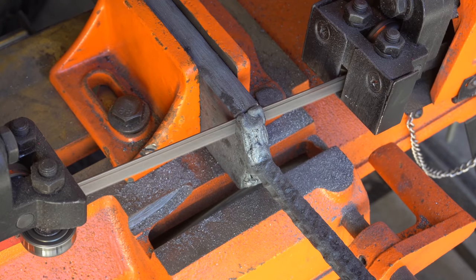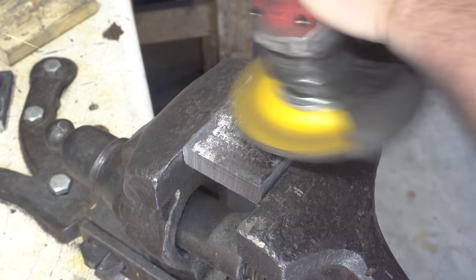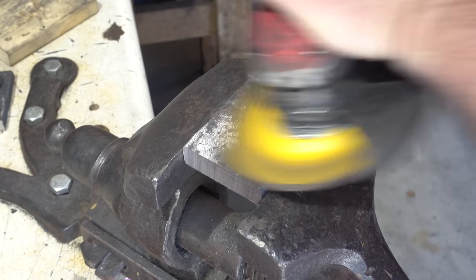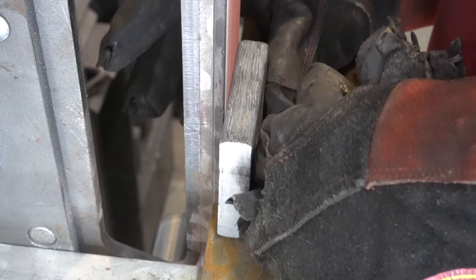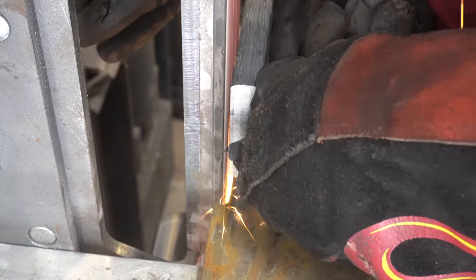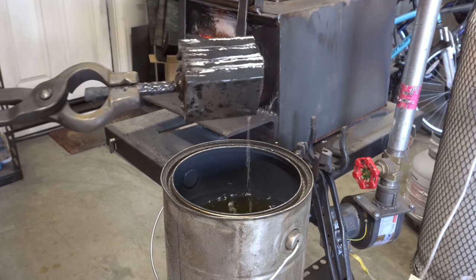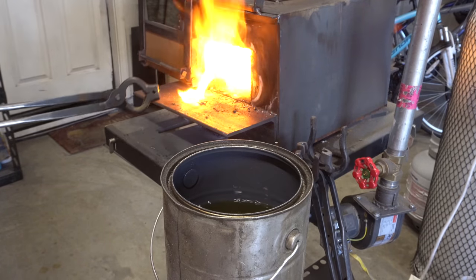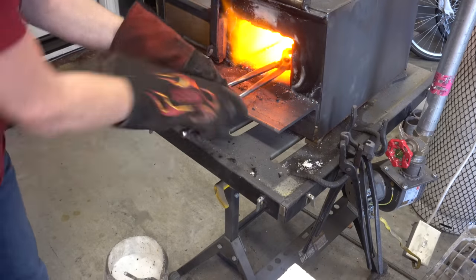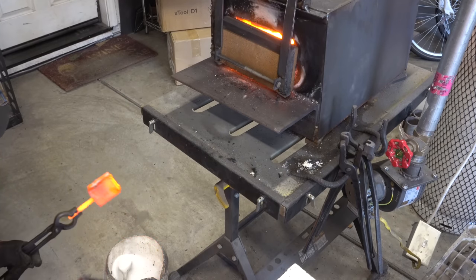In this video I'll take you through all the prep that goes into doing a restack for Damascus. I start out by cutting it up on the bandsaw. Now that I've got it cut into four pieces, I can take the angle grinder to take the scale off — this will save belts on the 2x72. Then I'm going to grind smooth all the faces that are going to touch. I've stacked them up, clamped them, and welded the ends. Now into the kerosene and into the forge.